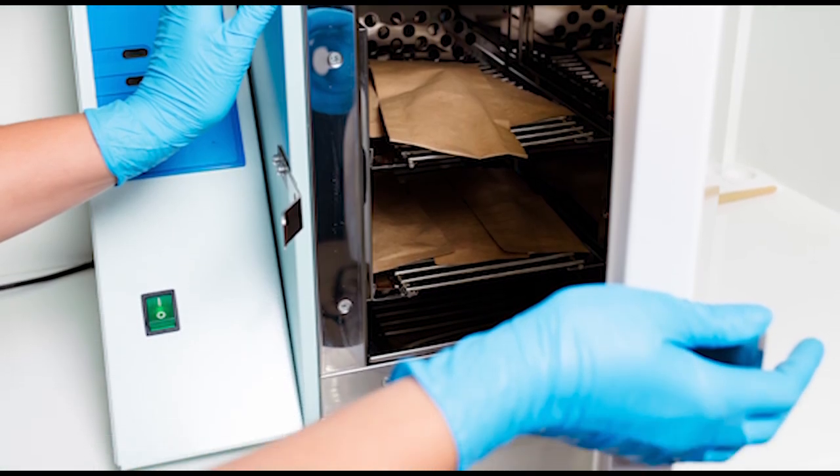Why this test? Xometry engineers have a lot of experience building medical devices using all our manufacturing technologies. We know better than most that materials really do matter. Many plastics, even those rated for medical devices, have a hard time withstanding an autoclave, which sterilizes items at around 121 Celsius and 15 PSI of pressure using steam.